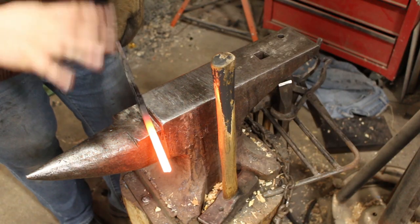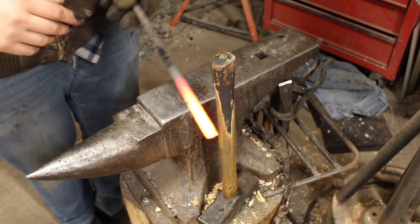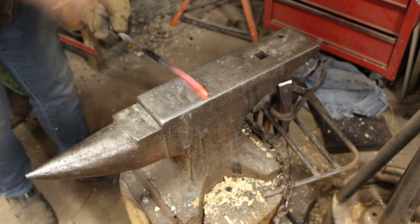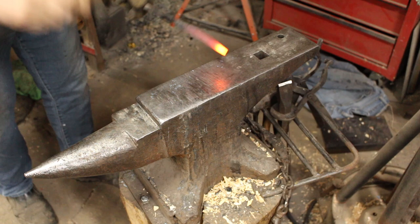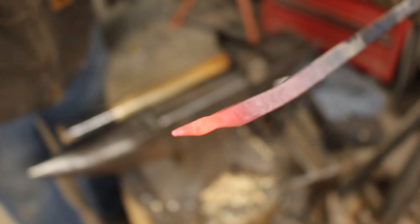Check this out — this is a glowing orange piece of steel, and I'm just going to let that cool down. Right now, this would be the opportune time to start working it down, but I'm going to wait. You can see how much it's heated back up on the tip there. I got it to a nice bright orange again as I was hammering it. When you're drawing out these tapers and points, if you can keep that metal hot and reheat it with that good rhythm, this will just make you more and more efficient so you don't waste the heat.